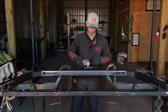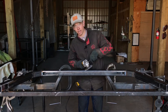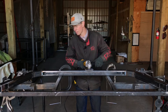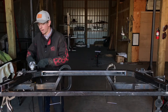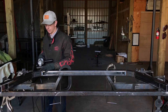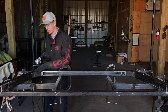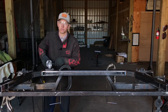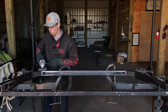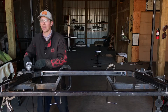And when you actually grind, the trick to having a perfect flat surface is you never want to tip your grinder side to side when grinding a flat surface. You always want to keep it completely flush and flat on the steel. Another tip is to make long passes — don't dwell in one spot too long or you're going to make a divot. When your weld is super tall and obvious, you can grind it off for a bit. But once it gets down close to the same level as your steel, start doing a smooth motion until it looks seamless. Don't tip your wheel, don't dwell in one spot. Once the weld is ground down a fair amount, just do a nice sanding motion.